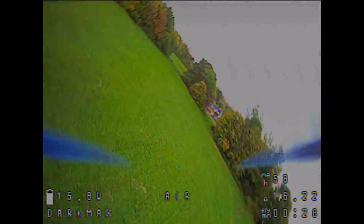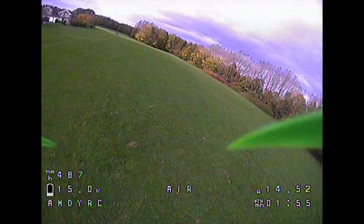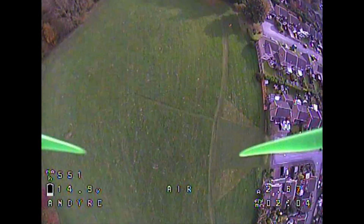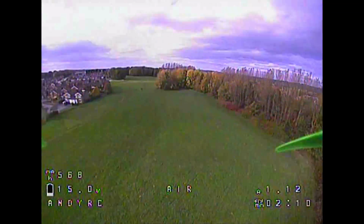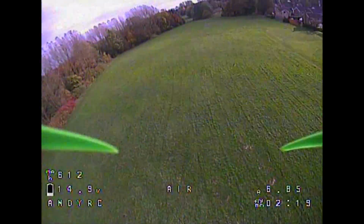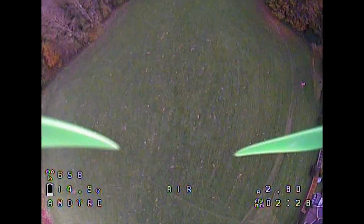Now, I think this VGA setting is a bug because the D1 setting is different. If the camera source is PAL and the menu in the DVR is set to PAL, then there's no cropping and you get a good picture, which is the correct way a DVR should work. And if you set the menu to NTSC and use an NTSC camera, then the image is also fine. This does mean, though, that if you don't choose the correct output on either your FPV camera or the DVR menu, then you will get some cropping, which isn't too much of a problem if you don't use an on-screen display, but I do. So as for the recording in the D1 option, it peaks at 14 megabit per second, which isn't bad at all.